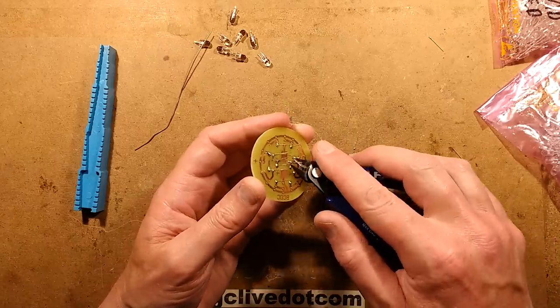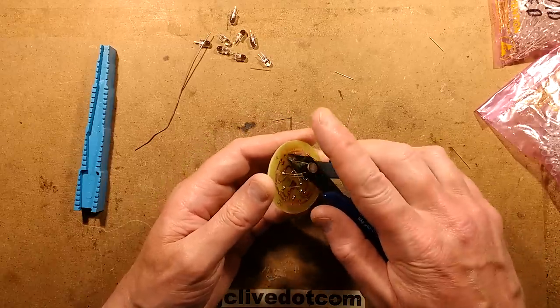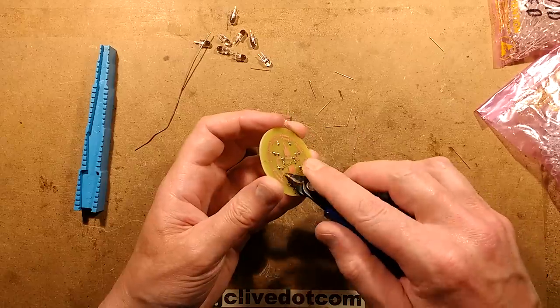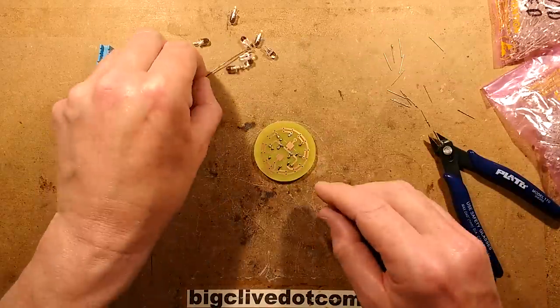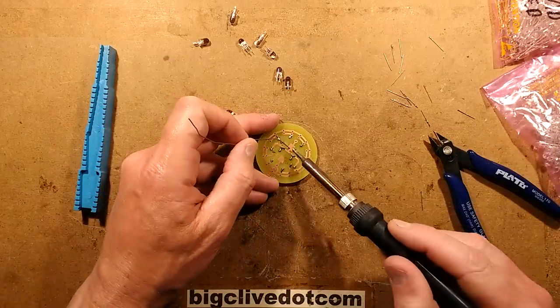And then we'll put the LEDs in. It's going nicely so far. I could even test this after I've put the LEDs in, even without putting it in the circuit board, on the bottle, should I say, because that resistor is just across the power rails. Now, here's an interesting thing. I'm going to put some solder on the big pads here, just at the moment.